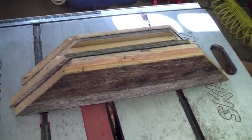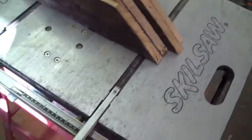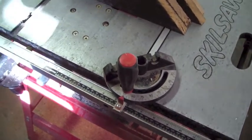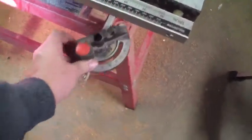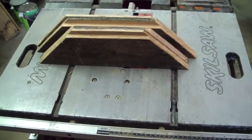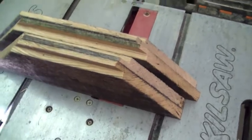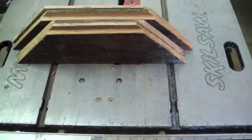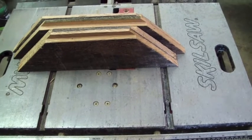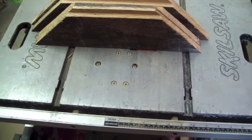Now I just have to find myself a better jig because I tried cutting with the table saw and all I have is this little crappy jig right here and it is not even close to accurate — way way off. I have my square on it and I have no luck with it at all. So I think I'm gonna go get cleaned up and then this evening I'll sit down and order myself a digital angle gauge so I can figure out how many degrees this is off. I might also buy a better sliding gauge that will actually allow me to do 45-degree cuts better.